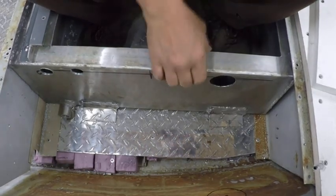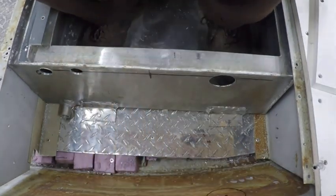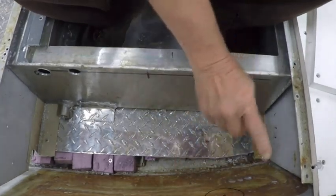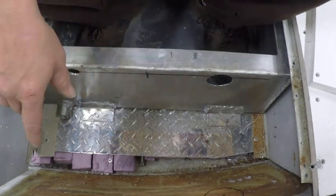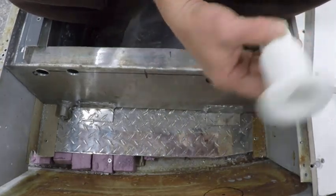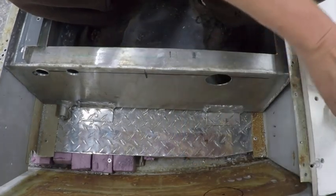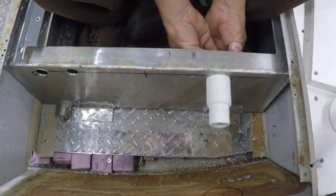It's time to get this live well done. Here's the outside of the live well right here — it's the outside of the boat. What we're going to do is put a through hole right here going toward the outside. Originally I was talking about plumbing it where everything would go from here, catch a pipe, and then go to the back. I've gotten rid of that idea. I'd rather it be a short run, just like my big boat. So once I found this kit, might as well. I'm going to go right out the side right here — that's an inch and a half through hole. We're going to come right through the side of the tank. I've already drilled the hole for this through hole.